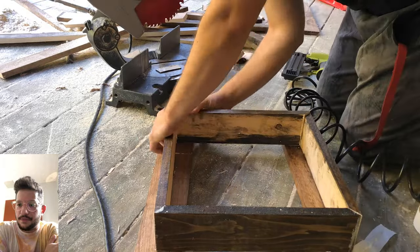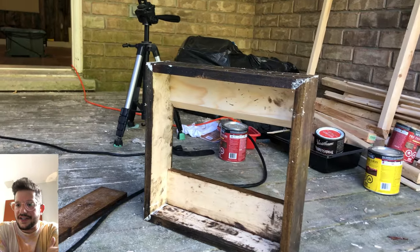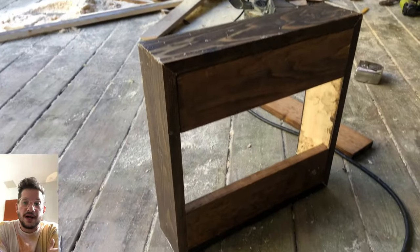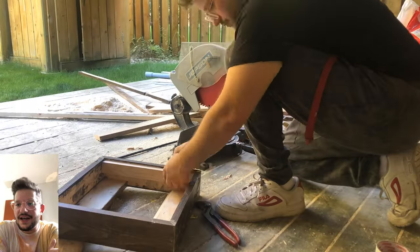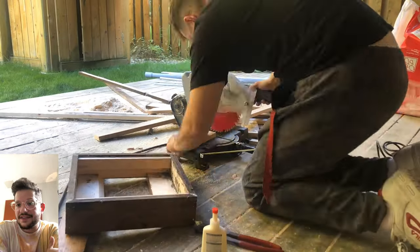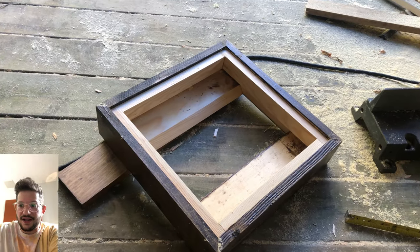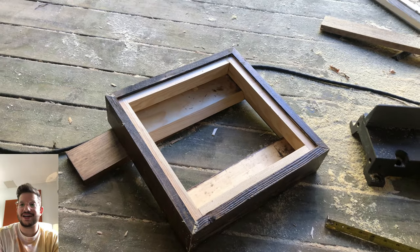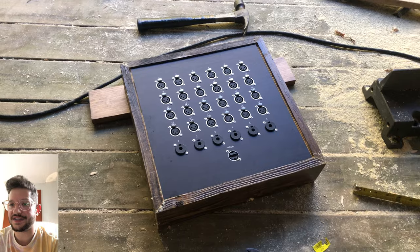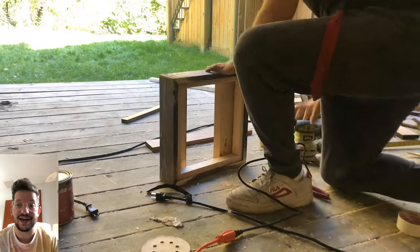There you can see the plate fits nicely in there. I added a top and bottom brace to add structural rigidity to the box, and it also gives us somewhere to screw the box right into the wall. Now I'm cutting up some scrap 1x2 to act as a rail — just like you would in a traditional rack system — adding this rail around all sides of the box and recessing that rail just about an eighth of an inch, using just the width of my construction pencil. That gives a nice little recessed edge for that wood plate to sit within. I'm going to go ahead and stain this entire box to make sure everything looks nice and professional — same stain and clear coat so everything matches up nicely with the wall and the rest of this entire build.